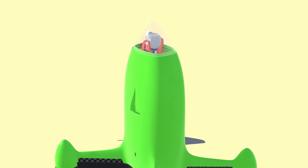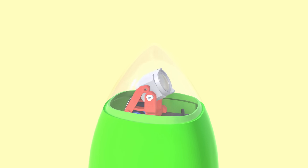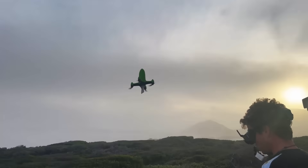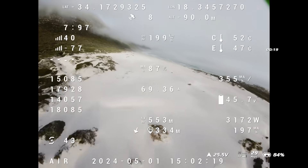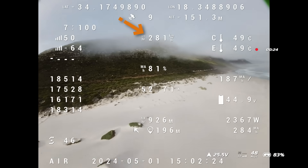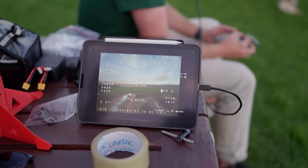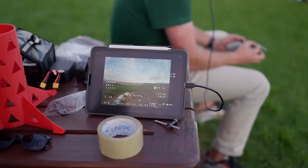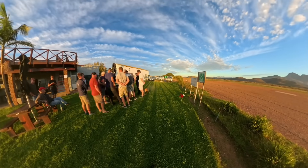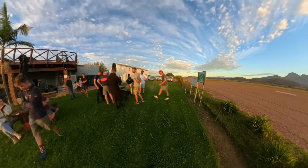The camera in the nose tilts from a servo for a perfect view during high speed and during landing. The HD video feed is transmitted via the antenna in the tail to Luke's goggles so he can see where he is going. Live telemetry is also displayed in the goggles to monitor speed, RPM, temperatures and voltage. The Guinness Record witnesses could watch the camera feed live on an iPad during the speed runs. We had assembled three witnesses to observe the best two 100-meter runs from four flights for Guinness verification.